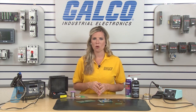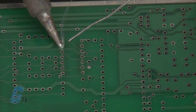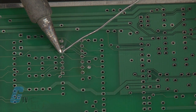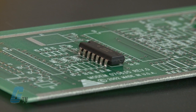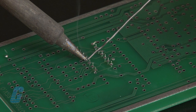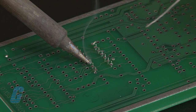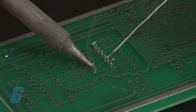The last issue is overheating the components. This is common when working with IC chips that can overheat during the soldering process. After making a few connections, I can touch the chip itself to see how hot it is to the touch. I may need to wait a little during the soldering process to prevent burning out the chip. Ideally, I would like to make a concave-like connection. Having the solder not go all the way through or bubbling up can create pockets of air and not make for a good connection.